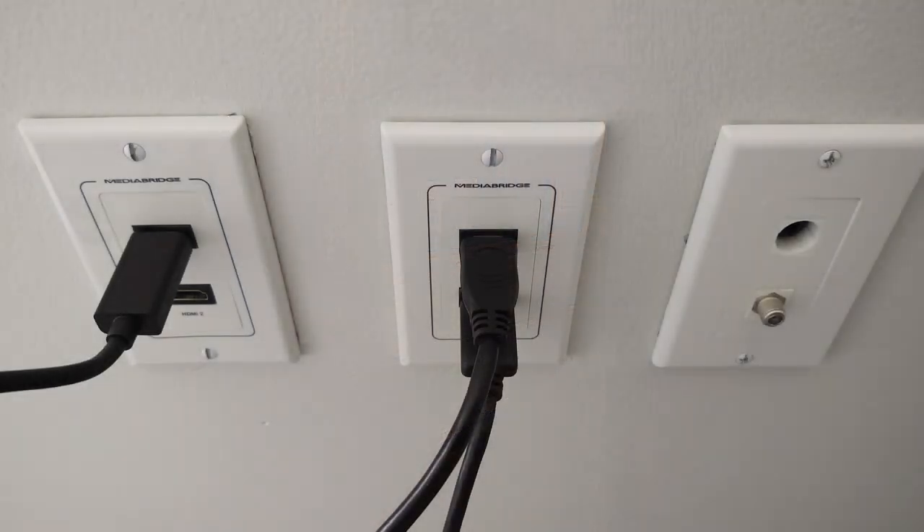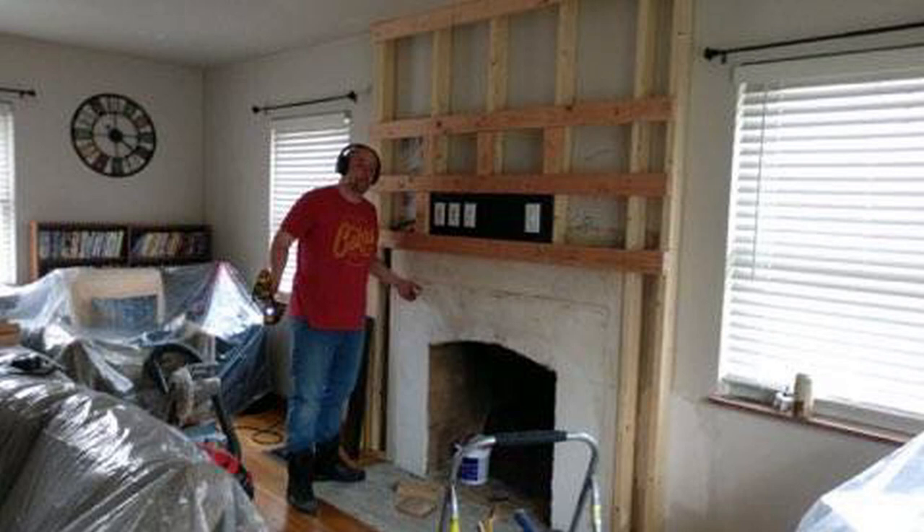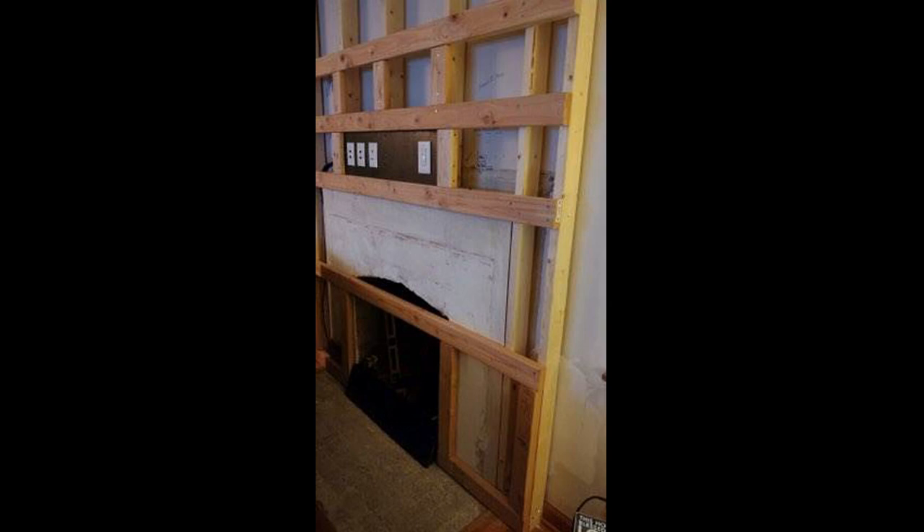The cables ran up a wall on the side of the room where I put plates so I could hook up my game console — a completely flush, stealth design. I didn't want any wires hanging or ever having to get behind the TV. I started the frame and put two-by-fours going horizontally across the wall to come out about another inch and a half, which worked out perfectly with the face of the fireplace. I anchored the new feature wall to the ceiling and floor the way you would when framing a new wall.